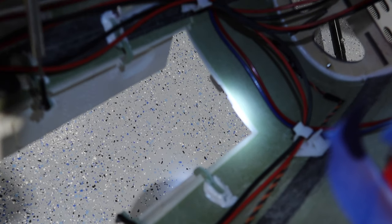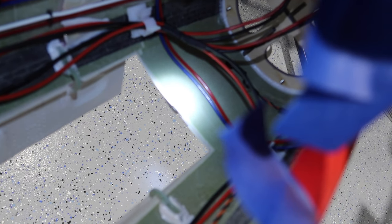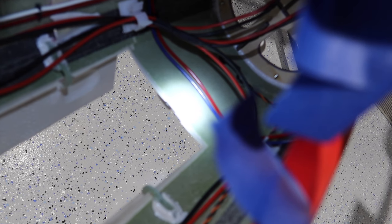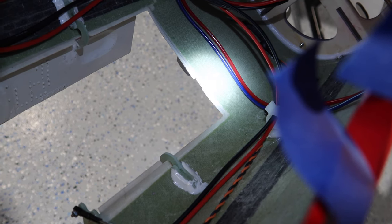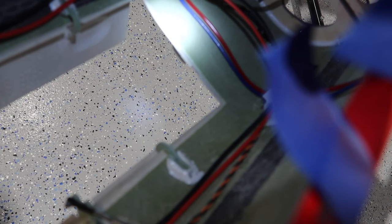This video is going to be a lot of little tiny things that we're just dealing with. So you can see right where the light is shining — while we were doing our initial gear tests, this section right here is really, really thin. The section over here is a little bit better but still really thin — those are the doorstop areas. This was overextending and getting stuck on the other side. So we want to create better doorstops there. I think what I'm going to do is cut that doorstop off and lay a piece of probably heavy fiberglass cloth in there and make another doorstop across that front section so it's a bit stronger.